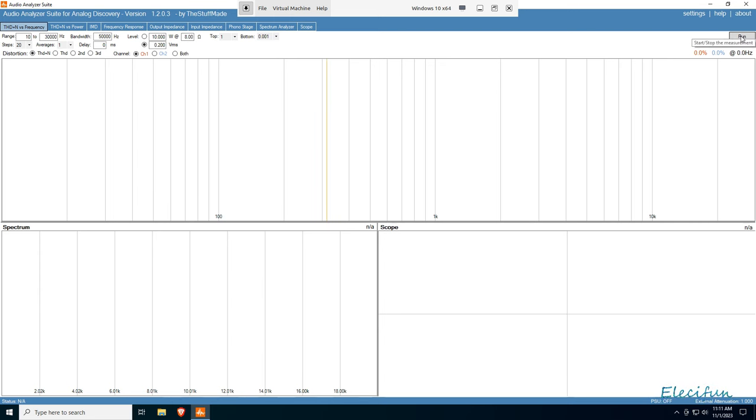And I don't see the point in putting the maximum voltage in, because that means you're running at full pressure. You're probably kinder to the components and everything else. And in reality, do you actually need that at full pressure? No, that's why I settled for 30 volts, because it would give me that 40, 42 volts output. And I can also use that on other amplifiers that say they can go up to like 45 volts, which is great. So yeah, there you go.